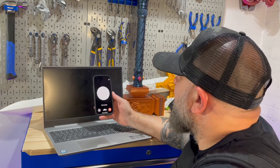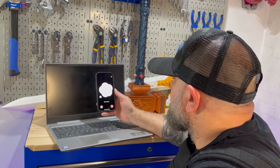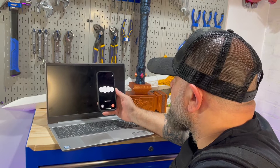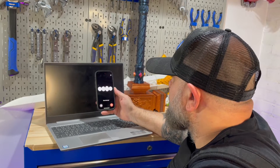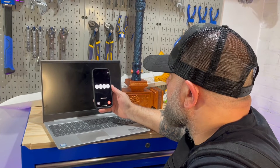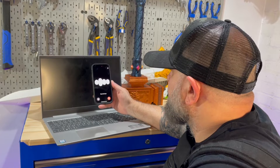What is the active ingredient in 3D Gloop? The active ingredient in 3D Gloop is a blend of solvents, including tetrahydrofuran, THF, and acetone. These solvents help to chemically bond 3D printed parts by slightly dissolving the surface, creating a strong bond as it dries.